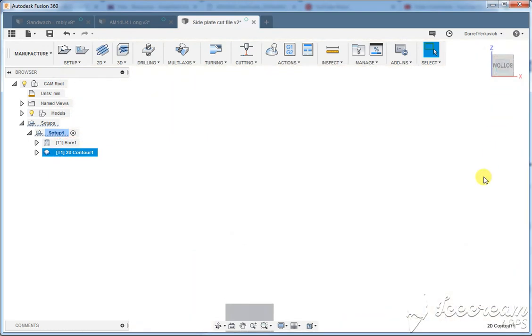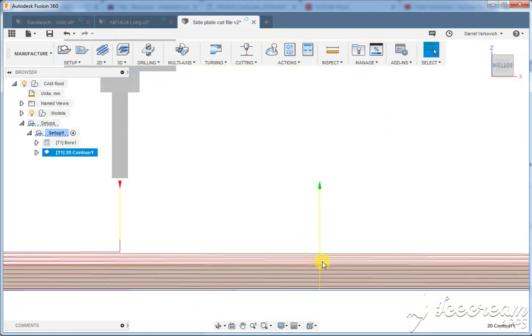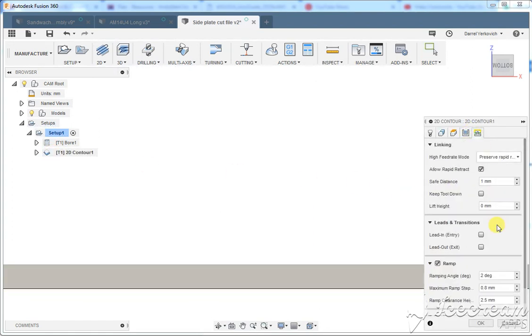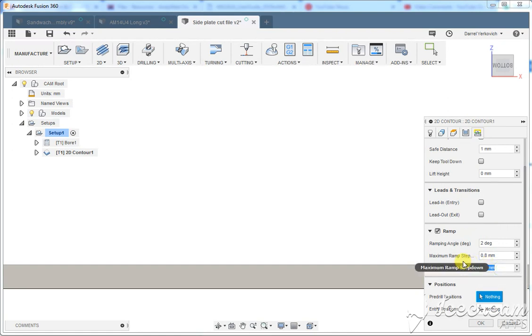With this, if we look at the side here, this ramp profile is starting like way above the part. So on larger parts, it just takes an eternity to get there. So that we would hide that. Where is that? In here. So ramp clearance 0.3 millimeters is fine.